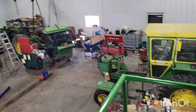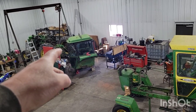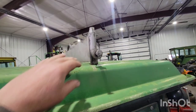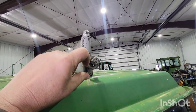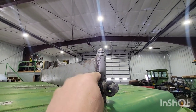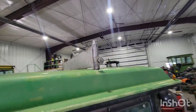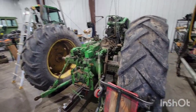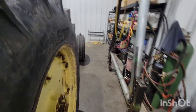We got the 40 and the cab is off, so let's look at what it takes to take the cab off and where we go from there. There are 5/8 bolts up here — just short bolts, take them out — then your lifting bracket bolts in. Make sure you've got it bolted in secure and you're safe, that's the big thing. It's really not that difficult to get the cabs off, just take your time and look at stuff.